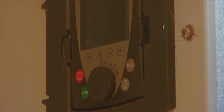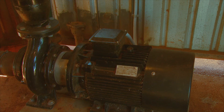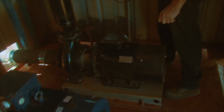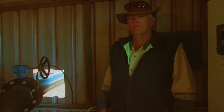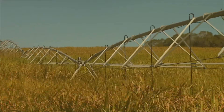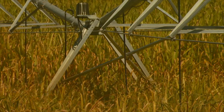The solution is a telemetry system linking a pressure sensor at the end of the irrigator with a variable speed control unit in the pumping shed. It allows the speed of the pump to be ramped up or down as required, maintaining an even 20 psi at the far end of the irrigator. The pump is a 22 kilowatt unit, running between 15 hertz at the flat and about 27 hertz at the top of the hill — roughly 15 amps and 27 amps respectively. It all happens automatically, which is proving to be really, really good.